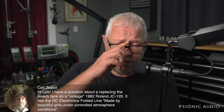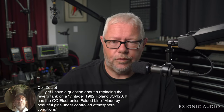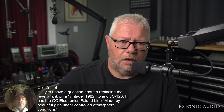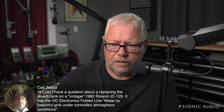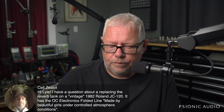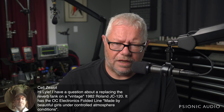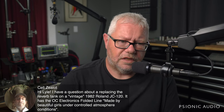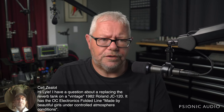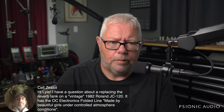But Antique Electronics, tubesandmore.com, does sell a wide range of MOD and other tanks. And if you look under MOD, it's going to be one of the E series, whether it's 9E or 8E or 4E. One of those is going to say JC120. You can Google that. If you Google reverb tank JC120, you'll find the part number you need.